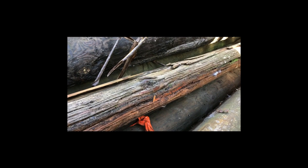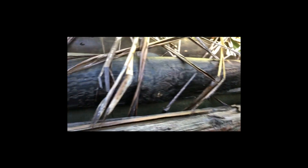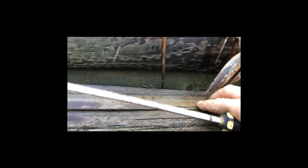If you saw this style of pole from the ground then clearly you wouldn't climb it, but sometimes they still have this sapwood on the outside and they look fine, but they're actually hiding all these splits and nicks and what have you inside it.